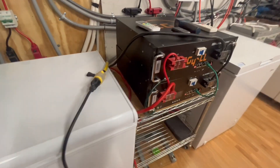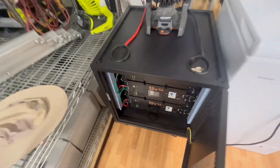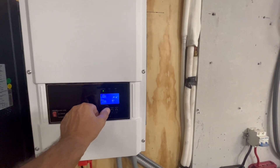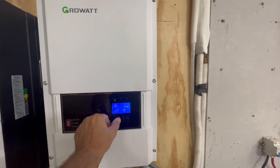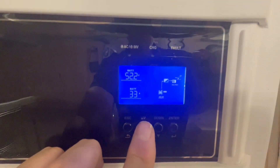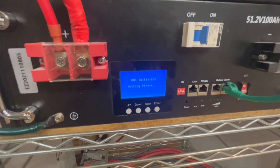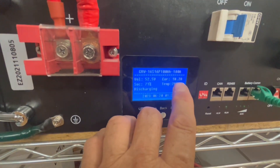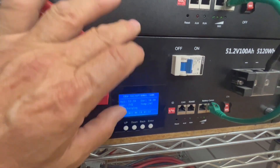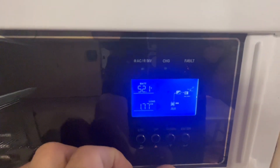These version-one units are about $1,500 to $1,600 delivered. You might be able to get away with one to run the unit overnight, especially if you were to super-cool your house first. We're at 1.75 kilowatts right now — as it gets hotter, you'll use more amps. We're using 33 DC amps, and right here we're discharging at 18.2 amps on each battery — so close to 37 amps total out of the batteries at almost 1,800 watts.